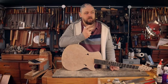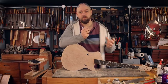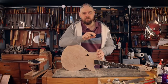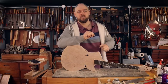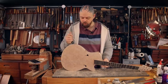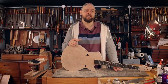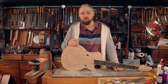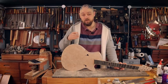And having ultra high gloss and then unpolished or unbuffed tiny inclusions is a problem. So that being said, I'm going to have to make some dust and make a mixture of wood glue and dust and fill all of the small holes. That causes an issue later on with regards to stain. Stain does not like going into areas that have dust and glue on, even wood glue, even when you have more dust than glue, as it were.